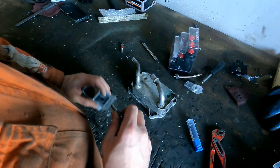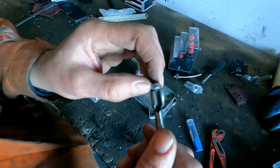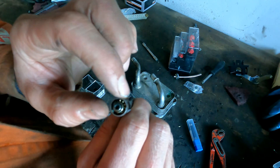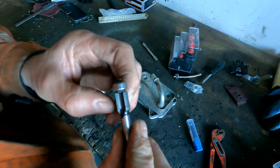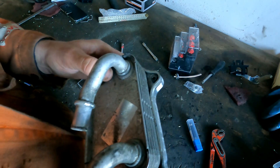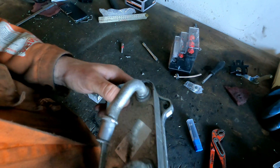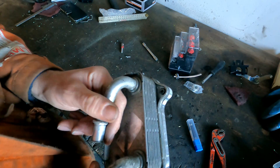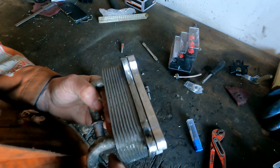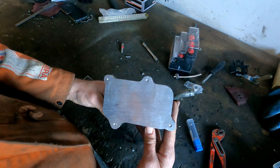The piece is done. I used this bit — I'll make a picture of it. It's still very sharp; you can see the bearing is a little worn — that's the first thing that always breaks. But there's no play in it, so it survived. The cut is pretty nice; you can see a little bit of roughness because I have to go opposite to the direction the bit is turning, otherwise it will slip. You have to be pretty careful. If you have a smaller bit, always mount something bigger on it so you have enough grip — same as when doing it with wood. Always watch your fingers.